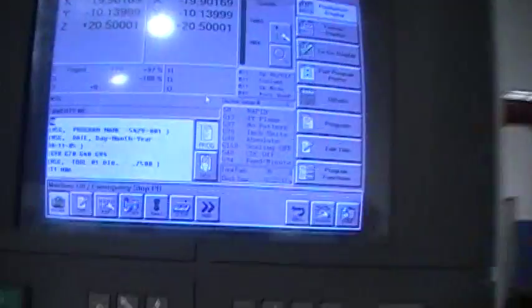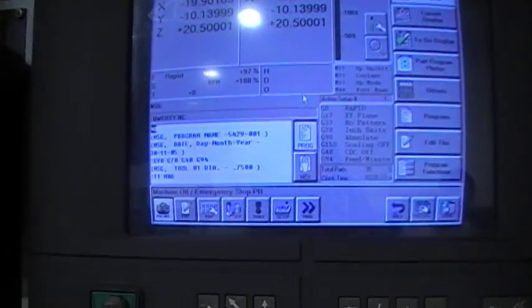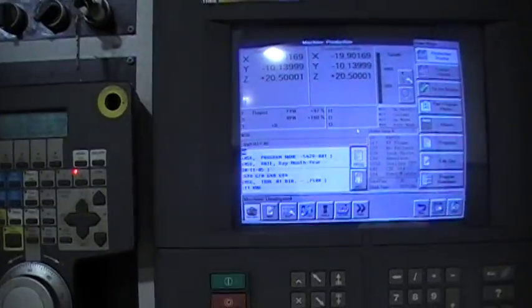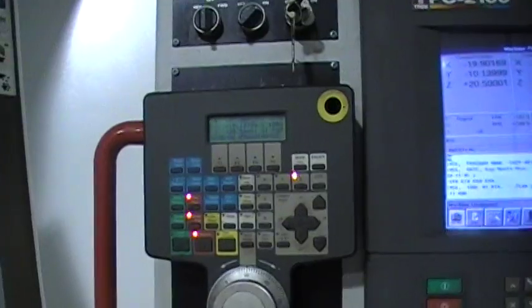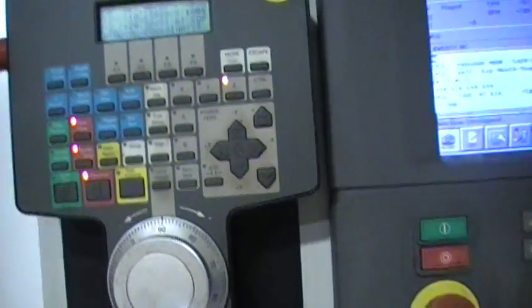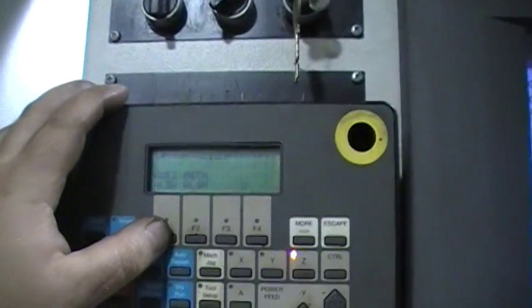We have the startup right here, so let's take it out of emergency mode — that's the machine emergency stop right here. We have the message 'machine is unaligned.' We also have a problem with the emergency button, and we'll put a brand new one right here. Let's start with machine alignment — we have 'align' here. Let's go axis align first. I'm holding the button and aligning it.